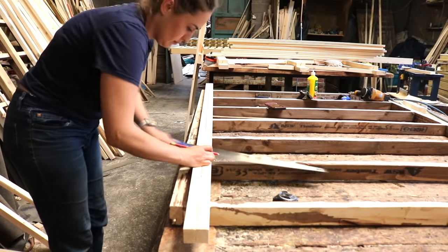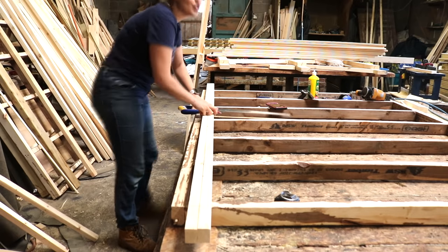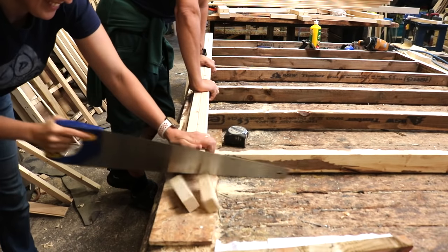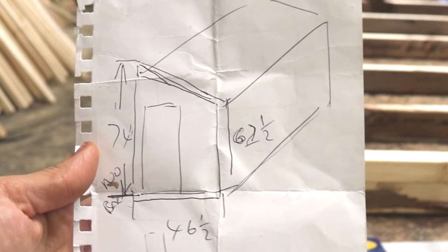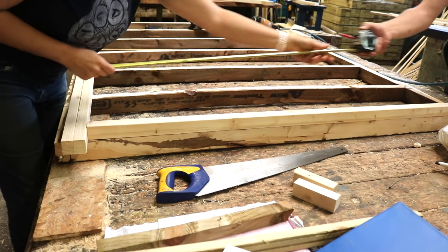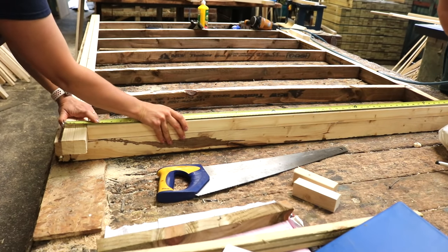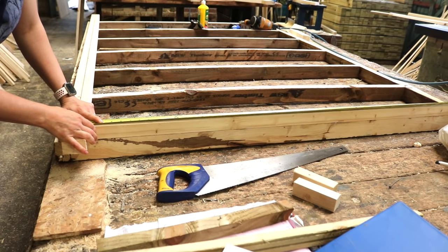I'm measuring every 15 inches from the start — these are where the upright spar supports will be. And instead of a clamp, my husband's holding them tight while I cut those down to size. Because it's a lean-to where I wanted rain to drip off, this side needed to be shorter than the end of the workshop it will be attached to. To work out the height of the upright spars, we pushed a long upright piece against the two and hooked a tape measure on the end, transferring our height mark on the upright. That new mark was the height all my spars needed to be for that side.